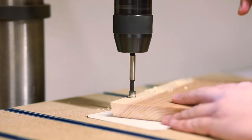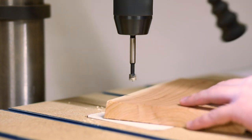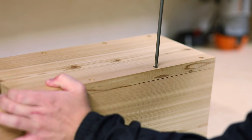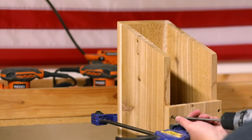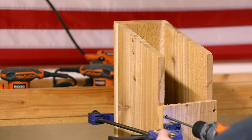I'm also using a small Forstner bit to countersink the screws. Once I have all of the stock pre-drilled I'm on to assembly. You'll see that I'm using a clamp and a fair amount of persuasion when assembling the four sides, and that's because this cedar is so gnarly. For most projects this wouldn't fly but for an owl house it's no big deal.